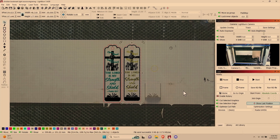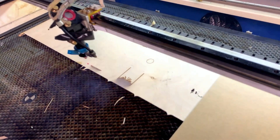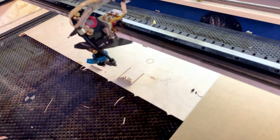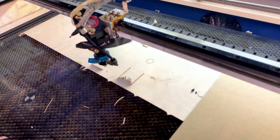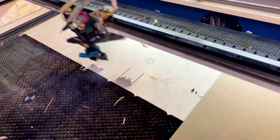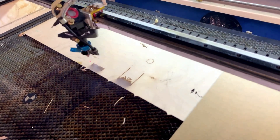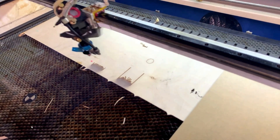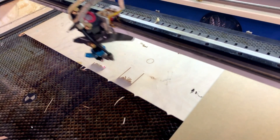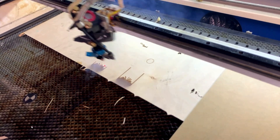Back to Arrow — select the graphic and then we will run it. I am using the CloudRay Ultimate Air Assist Kit, so it turns on and off when the laser is pulsing. That's why you hear the solenoid turning on and off. I have one CloudRay Infinity 6-inch inline fan at the end of the ductwork run providing fume extraction, and it's doing well enough that it's still pulling all the smoke in even with the lid open.